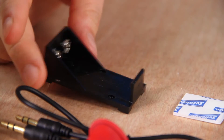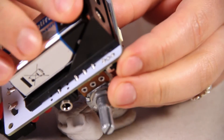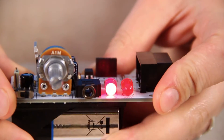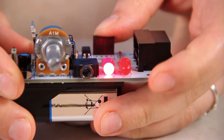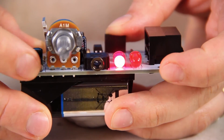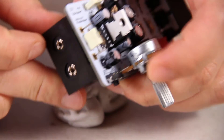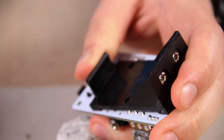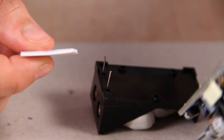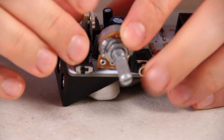Now we have to test that our circuit works. Take your battery holder, place it into where the battery holder is meant to be but don't solder it yet. This is the only component that goes through the other way on the board. When you turn it on the red LED light should light up — though sometimes it won't light up even if your board is working correctly, because you might have soldered the LED in the wrong way around, so you can check by playing sound through it. Once we know it's working we can solder the battery in. Take the battery out first so we don't solder it whilst it's in, then repeat the process. Before you solder it on, make sure that you use your sticky pads on either the PCB or the battery holder.